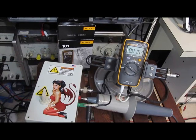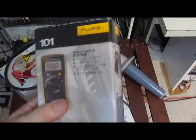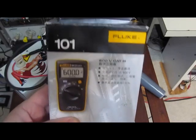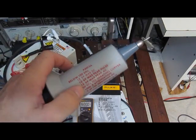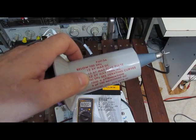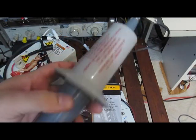This meter is pretty unbelievable — I can't believe it's survived all these tests. I'd almost like to take some other brands and run them against what this little meter survived at. For 50 bucks, I never would have thought it would go through all these tests. One more hit and we're done. Okay, we'll let this thing bleed down for a bit and then go ahead and take it apart and functional test the meter. The Fluke 101 passes with flying colors. The last test was performed at a little over 13,000 volts with a full width half height of 100 microseconds using the 2 ohm source impedance, and this meter didn't even flutter.